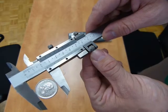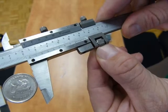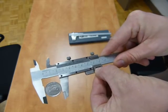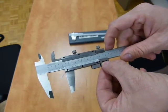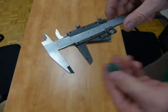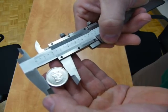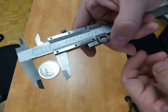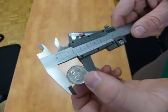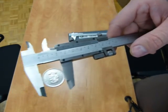Apply a quarter turn — because if my nails dig in here without sliding, I just rotate it a quarter turn and the coin is going to drop out. And if I rotate it back again a quarter turn, it's going to grab the coin again. So this way you can apply consistent pressure on the item being measured. A coin is not that much compressible, but softer materials will be or might be.